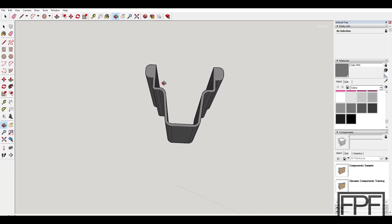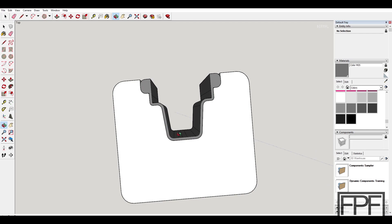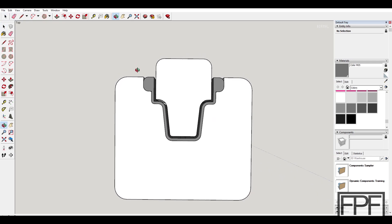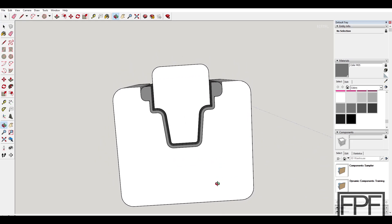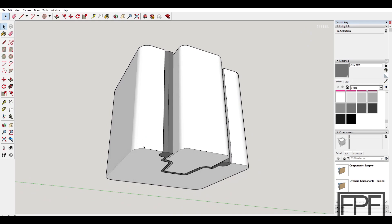Here is an extrusion of the drawing of the profile that we're trying to shape with the two dies. If I go ahead and unhide, here is our lower die — it matches exactly with the outer face of that piece we're trying to form. The inner die has a bit of a gap because this channel is felt-lined. I'm making an assumption that the felt is going to press down to about half a millimeter thick — it probably measures out to about two and a half to three millimeters thick now, but felt is largely going to flatten out. I made this 30 millimeters in height — I think that's going to be about right. I don't want to try and form the whole thing at once, but it's got to be thick enough to have strength and not separate.